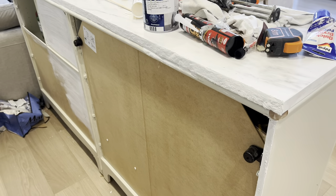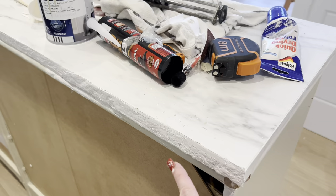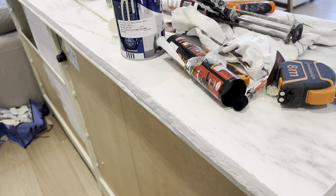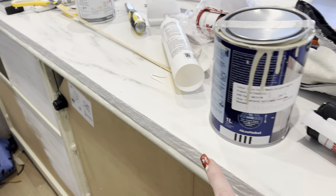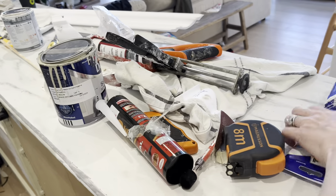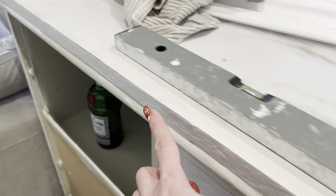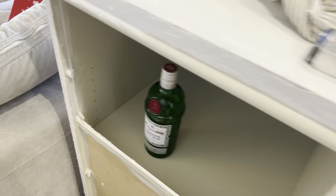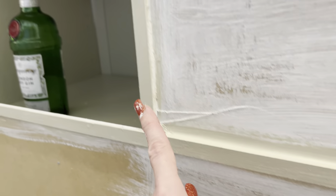I've been working on the back. I'm really annoyed — you can see this is a lovely straight line but this part was the machine cut and it was terrible. I've sanded and tried to fix it as best I can. Definitely use a saw. What I've decided to do instead of putting wood on it is just use some filler — a very light coat on these bits. I'll let it dry, give it a sand, and just paint it to seal the back. I've also cut a bit of the back out and used a little offcut — always keep offcuts — putting a piece across there.